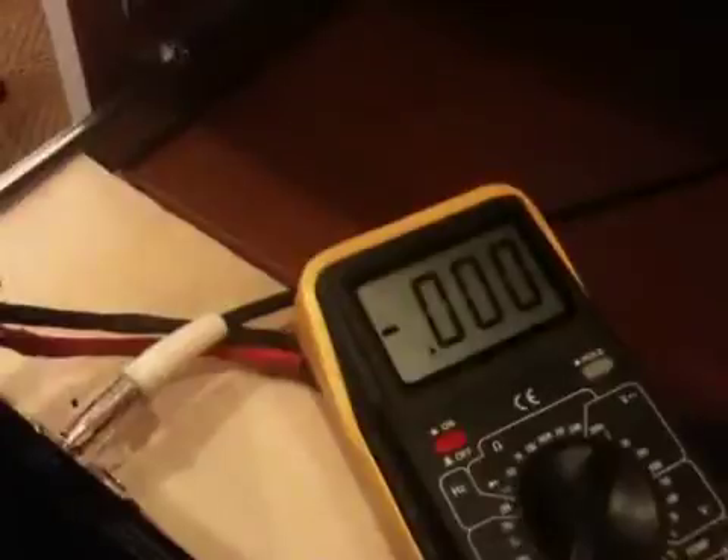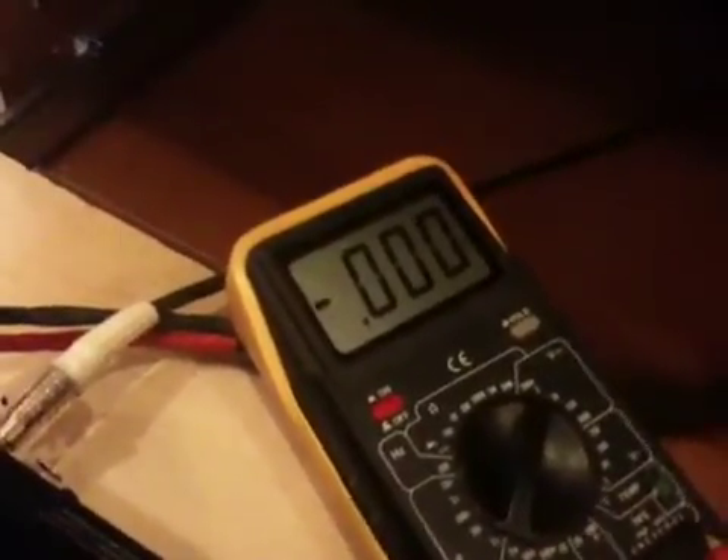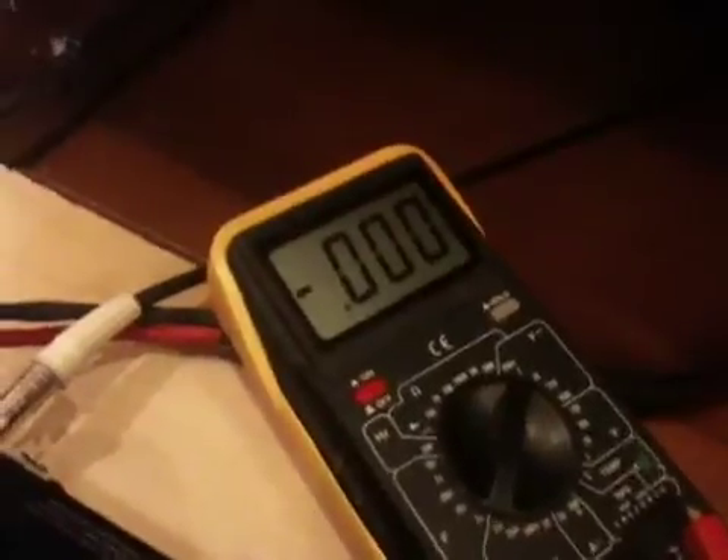They are just other points in the circuit, but I've got the amp open and it's fairly easy to do this — it just takes a few minutes. You can see here that I've already put the negative probe from my voltmeter into the negative test position, and up here I've got my digital voltmeter set in the 2-volt range on DC.